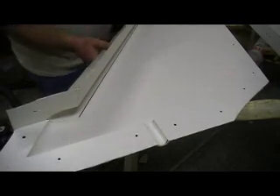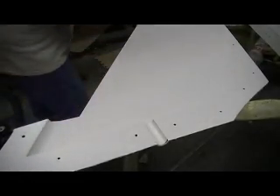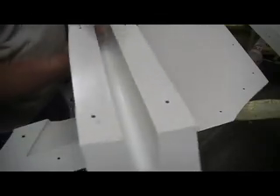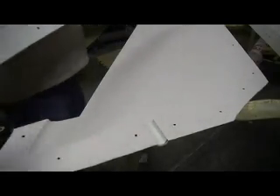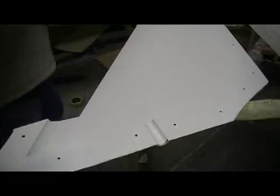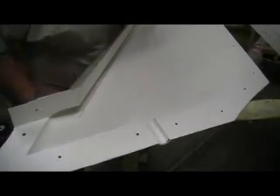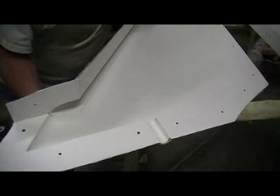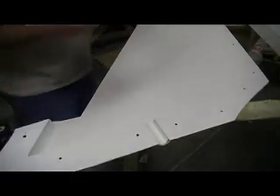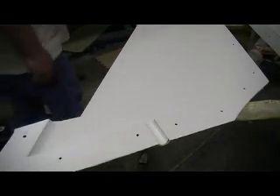Remember my flange trick? I'm gonna do that again. That way, once I get my structure in there, I can put some tape on the ends to where I'll get solid glue joints. Then I won't have no leading edge seam to separate. Anytime you can back your seam up off that leading edge, that's just a plus. I'll go in there and make me a nice flange — put my flange on this piece, then put my flange on that piece, put my structure in there, put my halves together. Bam! I'll have an elevator.